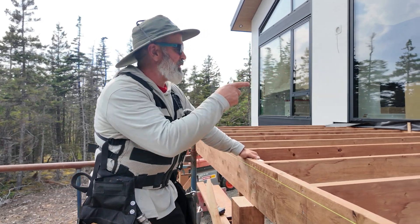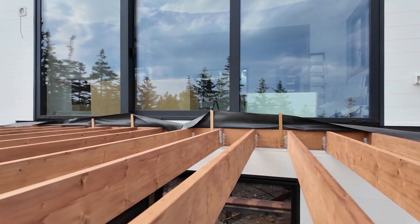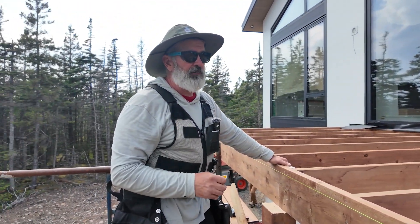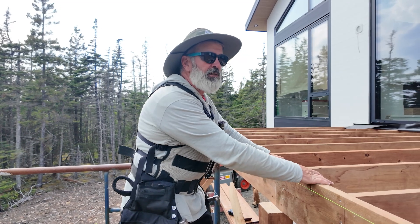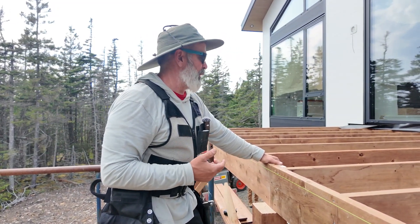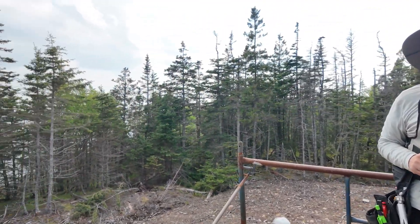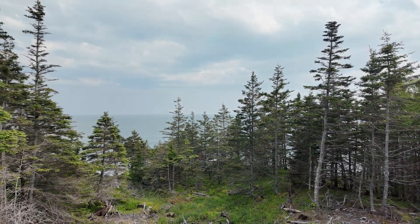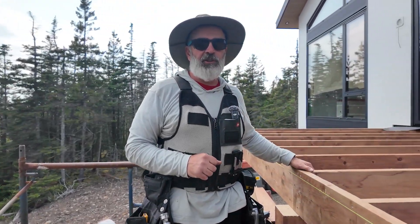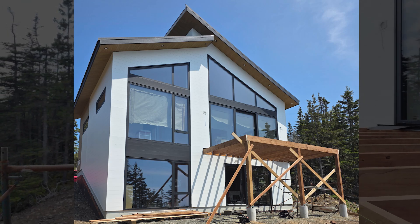You can see the EPDM against the house — that is going to be forming the deck bladder. The only reason we don't have our end joist in is I'm waiting on final confirmation of the rail design, so I can set that joist appropriately to accommodate blocking for the railing. There's nothing worse than not having adequate blocking in a high wind environment — very important. If your posts are well anchored, it's just going to give your railing that much better of a chance of standing up in this environment.